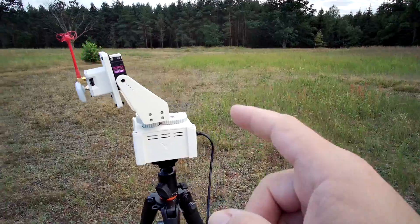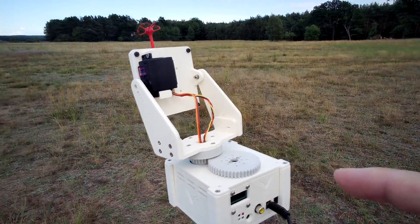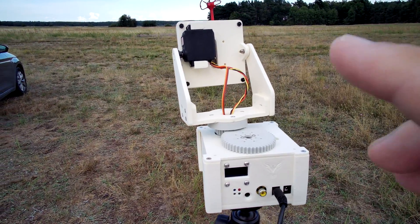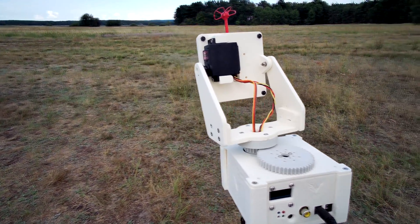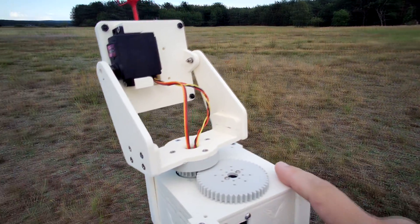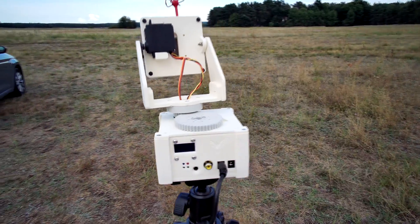What's interesting is that this antenna does not need any kind of special telemetry, because the telemetry is built into the OSD. Into the first line — line 0 of the image — there is information about the azimuth, distance, elevation, and so on. So the antenna tracker knows more or less what it's doing.